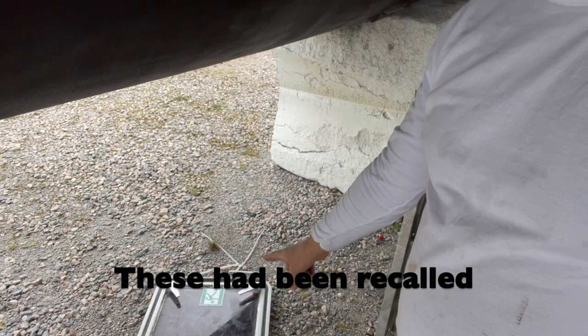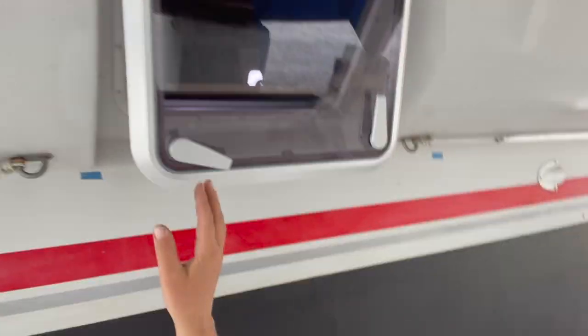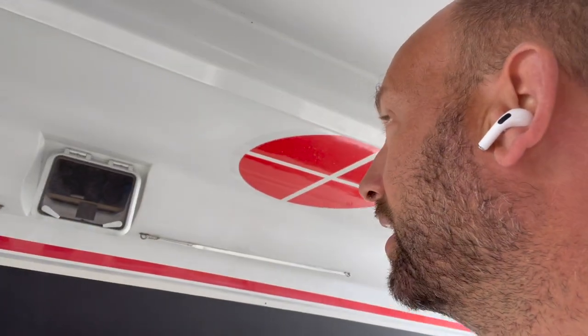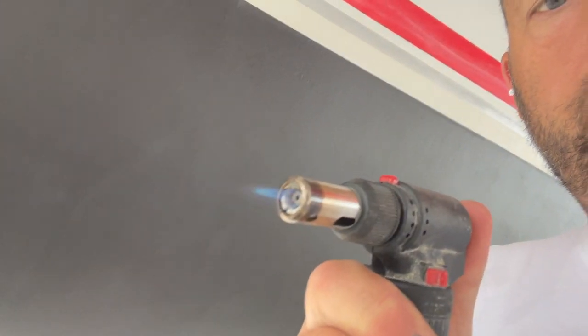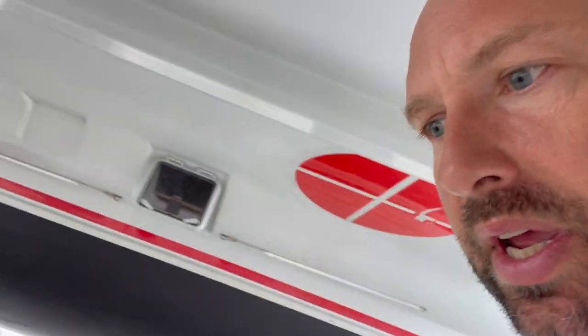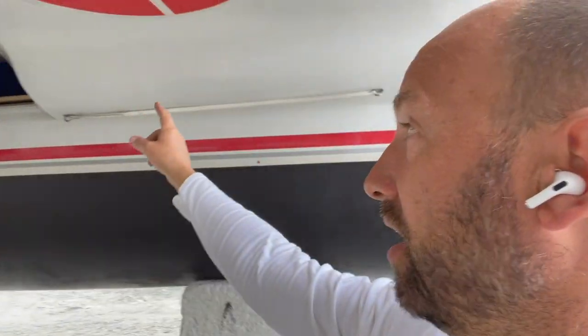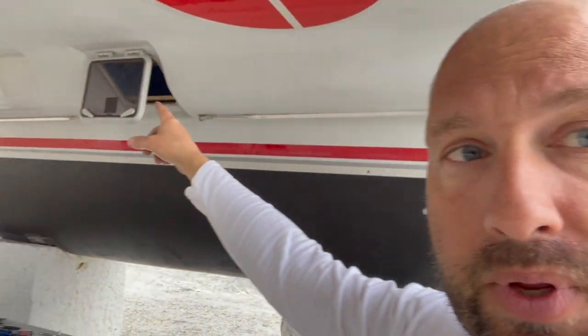Got another project just in the process of completing — that is the old hatch cover, and that is the new hatch cover. It was both easier and harder to replace than you would think. The screws up there just need to be taken out, but the bolts on this side are stripped and we can't get them out. Used a butane torch to heat it up to try to expand the bolts, and that wasn't working. Also used a dental toothpick to scrape out the oxidation around the side to help. I got all the bolts out on one, but only one loosened on this hatch, so we're going to have to drill out those bolts. But as soon as you can get the bolts out, it's not too bad of a replacement.